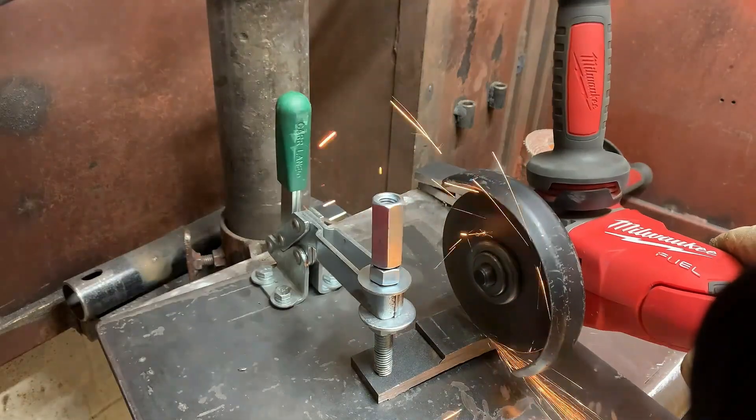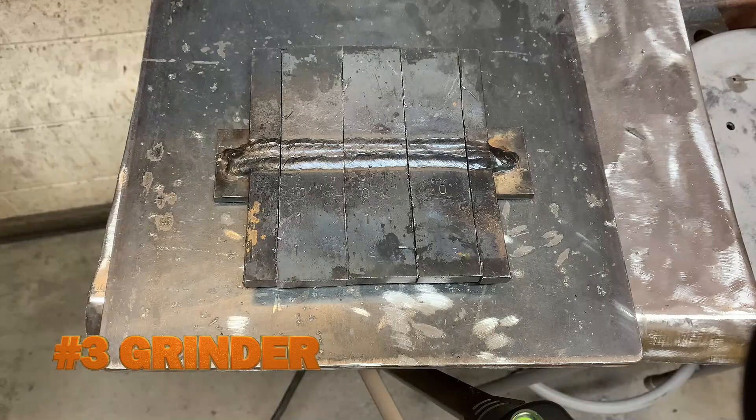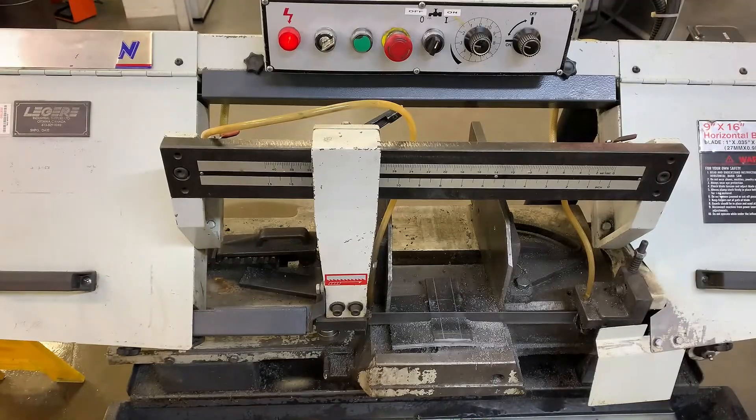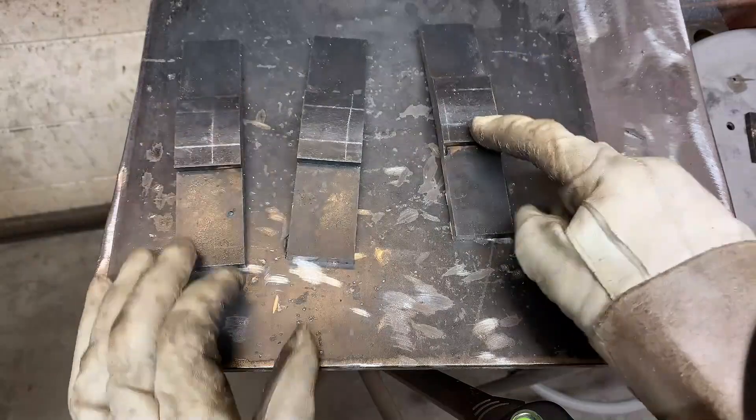Option number three is a little bit less appealing, but if we don't have the saw, if we don't have a mill, if we don't have a torch, we can definitely process this coupon for destructive testing. We're going to get that angle grinder out, get the zip cut, get your hard disk, your flapper — get it all out. Make sure you've got that respirator because you're going to create a whole bunch of dust. Once we've got that plate all cut up, we want to discard those ends and just keep those three coupons. In this case, these are an inch and a half coupons and I like to isolate them so they're one by one.